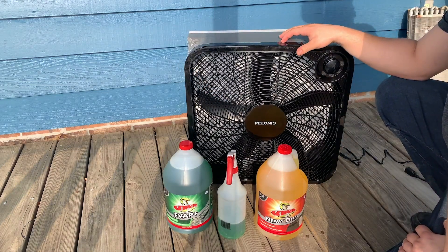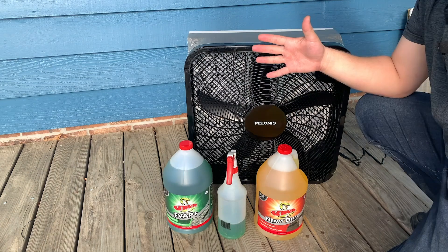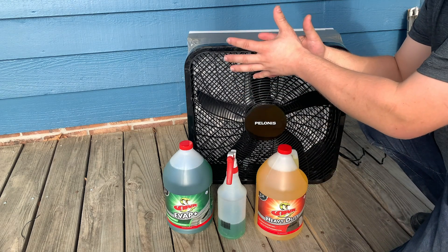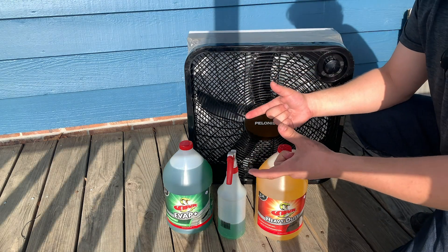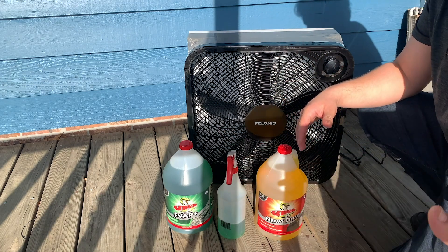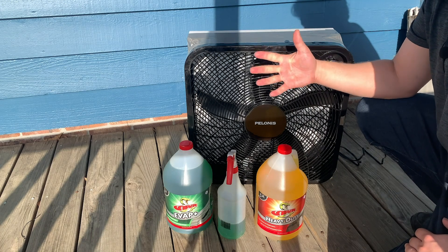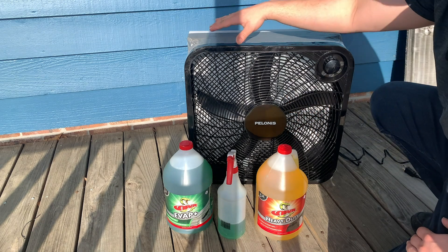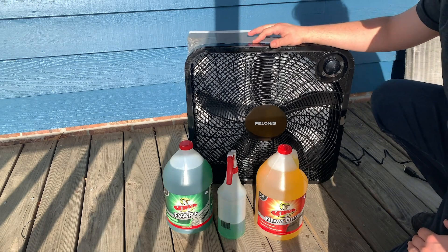Another way you could do this, in lieu of a fan, is to buy a filter that matches the dimensions of your window. Make sure the arrow on the filter is pointing in towards the inside — towards you — if you're installing it from the inside, and then tape around the filter making sure there are no air leaks. You could turn on your bath fans to create a negative pressure inside the home, and as air comes in, you're filtering it before it enters. That way you're getting rid of pollen, particulate matter, vehicle exhaust — things like that. It's another way of doing good ventilation while also filtering the outside air, making sure it's fresh as it comes in.